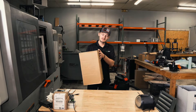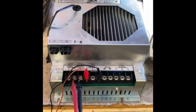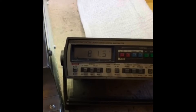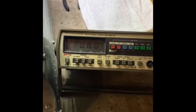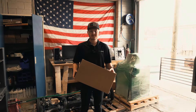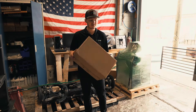Wes here with CNC Wise — your expert source for Haas vector drive repair, located in Denver, Colorado. Today we're going to show you a before and after test on this repair service. What we're showing you here is the low voltage alarm that this drive generates on power up — it's supposed to get to 335 volts DC and you should hear a relay click, but this one does not do it. It only generated about 80 volts DC. After the repair, the DC bus gets up on initial power up, and after three seconds you hear the relay click — now it's up to proper DC bus voltage. The repair is complete and testing went well, so we're sending this back to Justin for reinstallation.